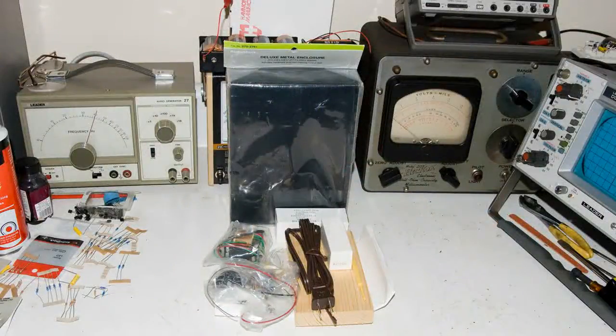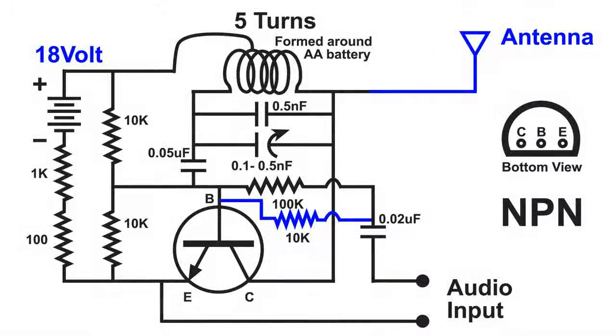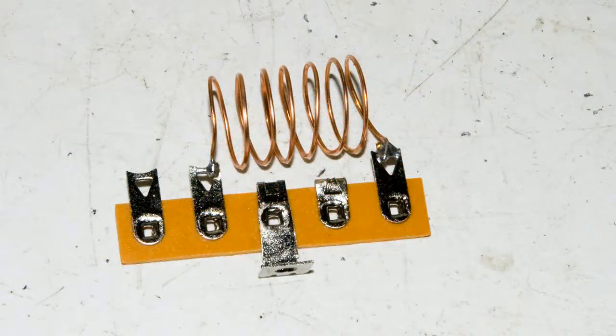I've taken a look at the Antique Electronic Supply transmitter's diagram, also my past AM transmitter diagram, and my most recent FM transistor diagram, to get an idea of what I want to do. By the way, that transistor FM transmitter works very well. So I decided I'll form a coil around the AA battery, this time using seven turns, and here I've mounted it on a terminal strip. That way, if it's too many turns, it's much easier just to cut it down.